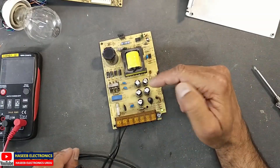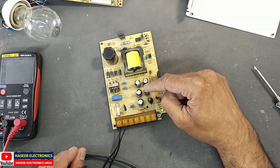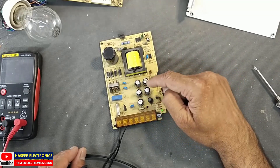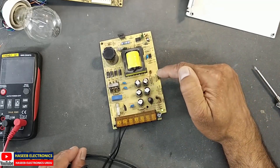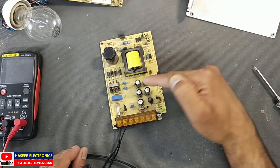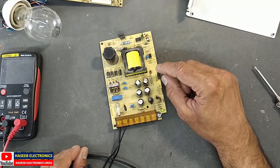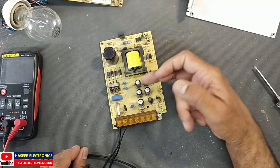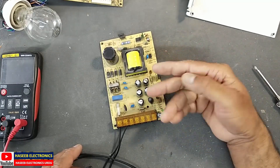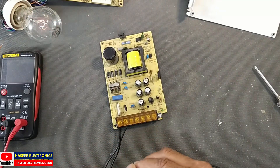There is something short circuit in the secondary. These are the capacitors, and this rectifier might be short circuit, which caused damage to these capacitors. If the rectifier is working normally, it gives positive voltage — a positive voltage might damage a capacitor, but that's somewhat normal. However, if the rectifier is short circuit, negative pulses are applied to these polar capacitors, and polar capacitors behave very badly with negative pulses — when reverse voltage is applied, they become short immediately.